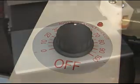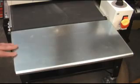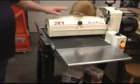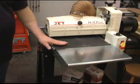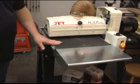If you do a lot of long work, Jet has these extension tables available that expand the supported surface to 42 inches. Because the drum is only supported on the inboard side, we can sand pieces that are up to 32 inches wide. We just put it through, make one pass, turn it around, and make another pass without adjusting anything.